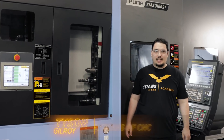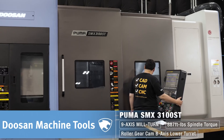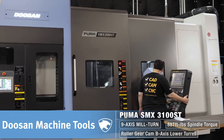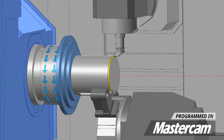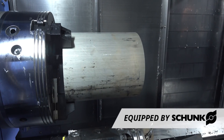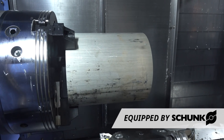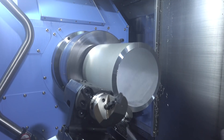Hey, what's up everyone, this is Tyson at Titans of CNC. Today I'm standing in front of the Doosan SMX 3100 and I'm going to be running my program for the Titan 123M. In my machine right now I have a big chunk of aluminum which is 8 inches in diameter, being held on by Schunk claw jaws in the Rota THW+. For the first tool we're going to do some lathe work — I'm going to be facing the part and then doing some pinch turning to rough out the OD.